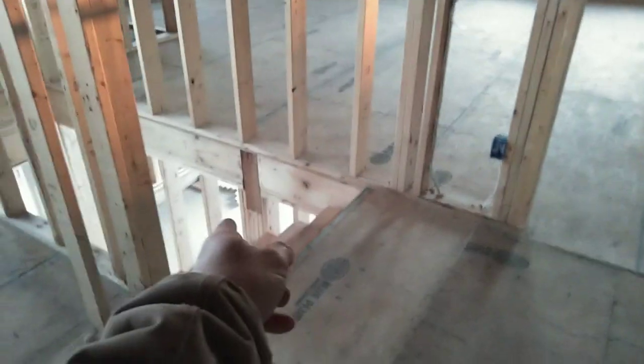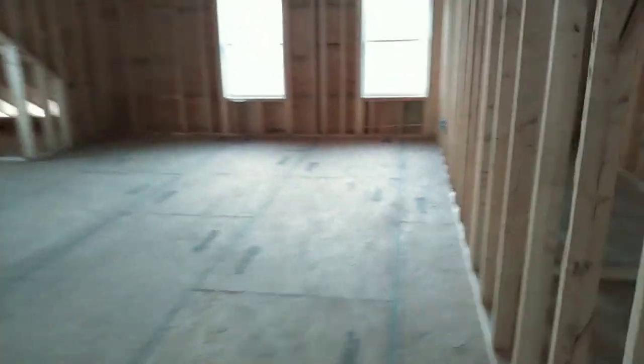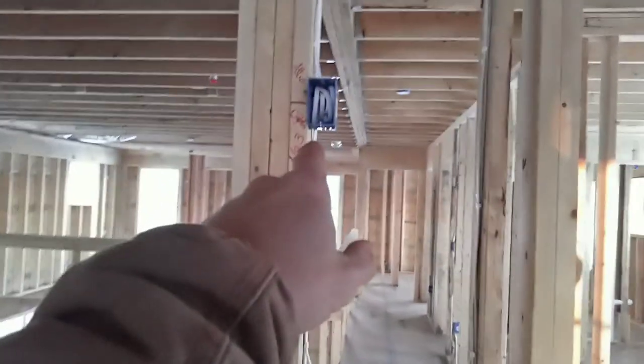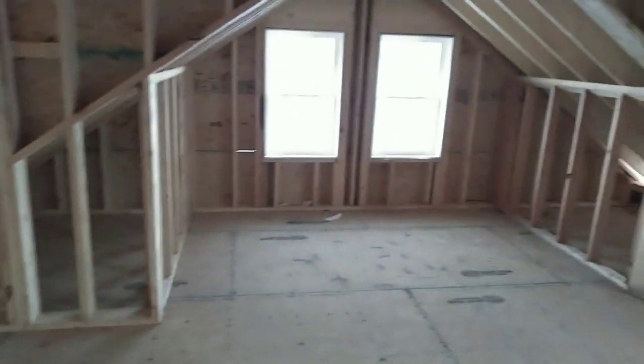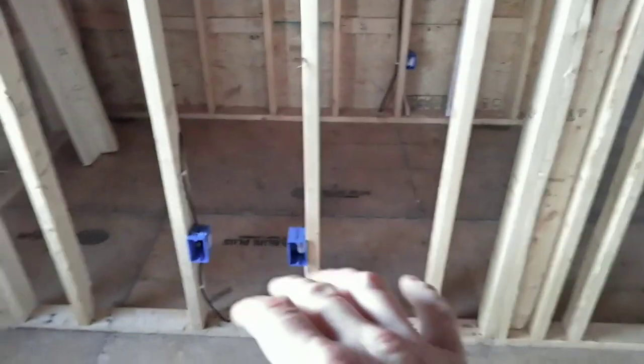Leaving that bedroom — this is a bonus room over the garage. You can see the garage right there. This is an unfinished bonus room, so he's had me prep it with a fan-rated pancake box and one switch here for the attic light. There's going to be a pull-down staircase right here. This covers the attic light and the light for the room. This is a future bonus room — none of this will be sheetrocked, just insulation in these walls. The owner is choosing to finish it at a later date. I did a future TV location here and a future power port, and I'll put a blank plate on it. This room isn't getting any power — no heating or air equipment in here.